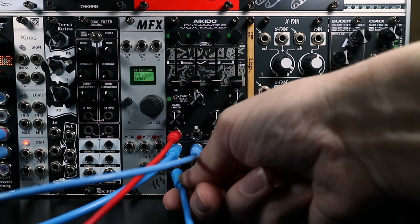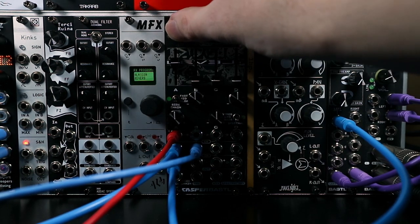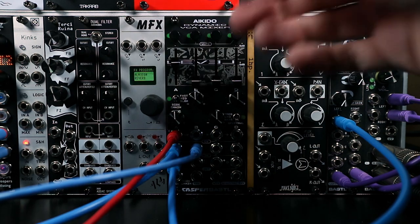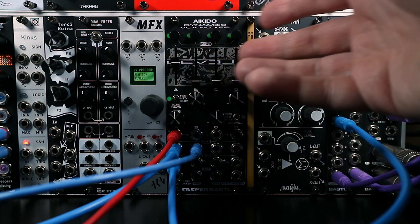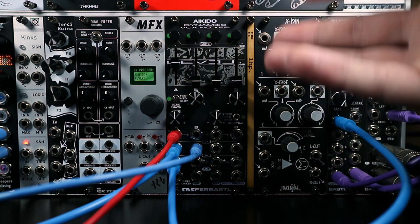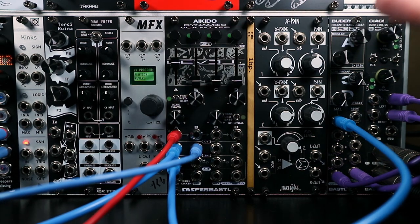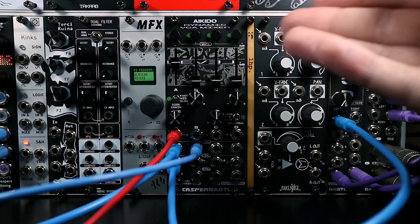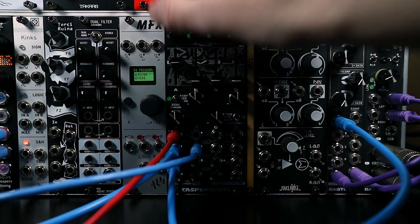The alternate jumper setting means your mute button also affects the VCA output as well, and it's going to depend on what you're trying to do in your particular setup. For example, I had a patch where I had a kick drum in channel one being used for sidechain pumping — if I wanted to stop the sidechain pumping, I could mute the kick and the pumping would stop too. If set up like the default, when you muted the channel you'd still get that pumping, which depending on what you want might be desirable. Having that flexibility is really useful.